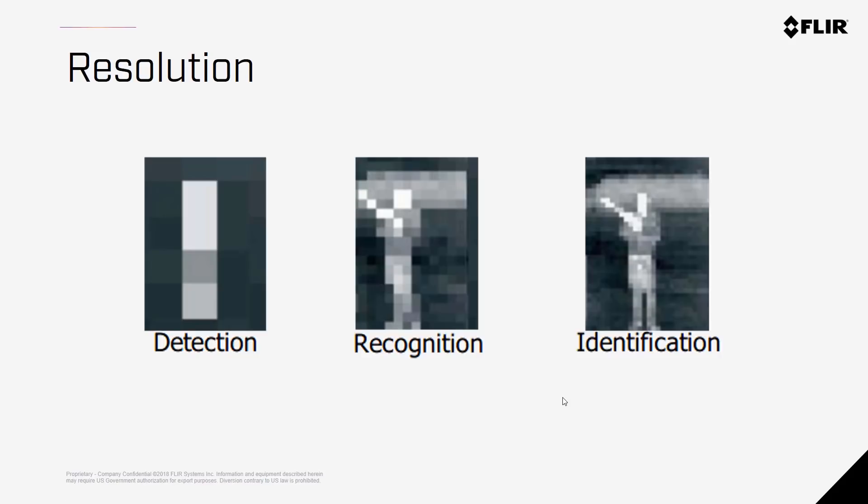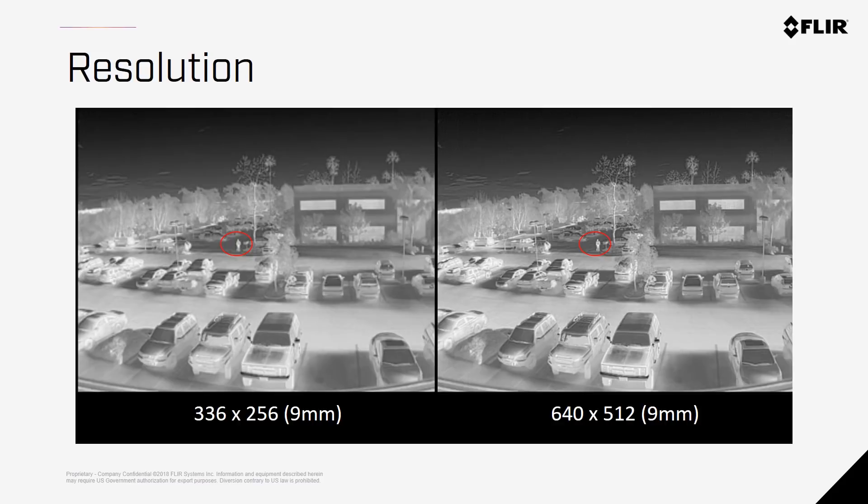These cameras don't represent X-T2 imagery, but just to illustrate the point — here are side-by-side images of a 336 and 640 original Zenmuse X-T. At this distance, the images are not too dissimilar, but as you fly higher, you'll see more clarity in the 640 versus the 336. If you look in the distance at the pixels between the person's legs, you can start seeing distortion where the pixels are being averaged out, causing blur between the legs.